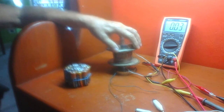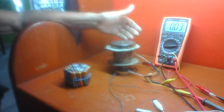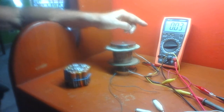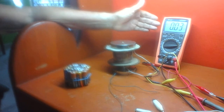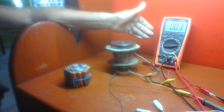Now, there's no electrical connection between the electromagnet and the bifilar coil. The bifilar coil is only for output alone. And I have the two leads hooked up to my voltmeter over here, set on the 20 volt setting AC. Now, what I want to demonstrate is how the output is greater on a neutralization pulse than it is on the positive pulse, okay?